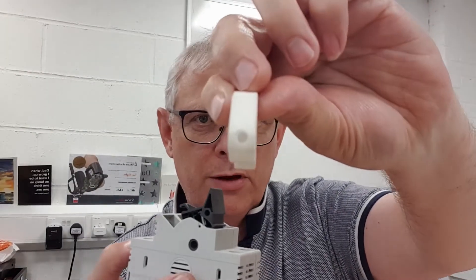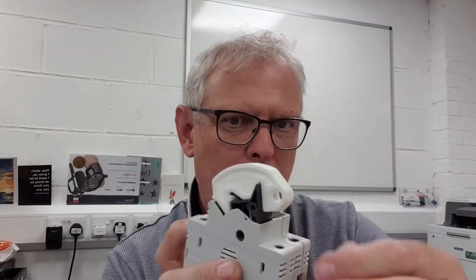The next element of the design was to introduce a method whereby you could actually grip it on. The conventional method is putting a threaded hole with a grub screw that tightens up and pinches onto the toggle. So we first went to 3D print and produced this version of the design. You can see it's got the hole where the grub screw would go and a hole here also for the padlock. It fits on quite nicely — grub screw's not currently in there, but when you pinch that up with a screwdriver, that grips on there, padlock through, job's good.